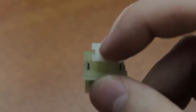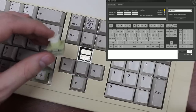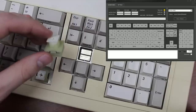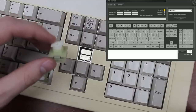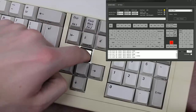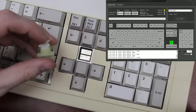A loose switch like this is one of the absolute best fidget gadgets I've ever seen — I could click this thing all day long, it's super satisfying, and the sound is really cool too. I used this keyboard with one of the switches taken out for the entirety of the testing period, mostly to study the design, but thankfully you can still use the key even when the switch is removed. Being capacitive, you can just touch the capsense pads with your finger and it'll register — a useful trick to determine whether a capacitive PCB is still working properly.